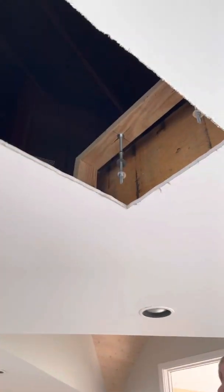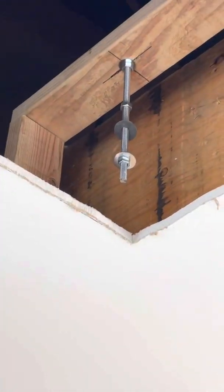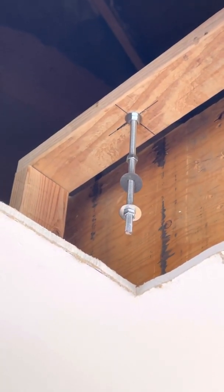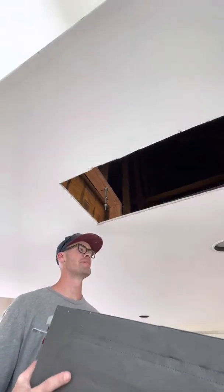We put these little bridges in. You can see we tighten them all down. We put an insulated washer there and then a washer on the bottom with the three-eighths nut and the all-thread. And then basically you do that on all four sides — that's so that you can catch everything.